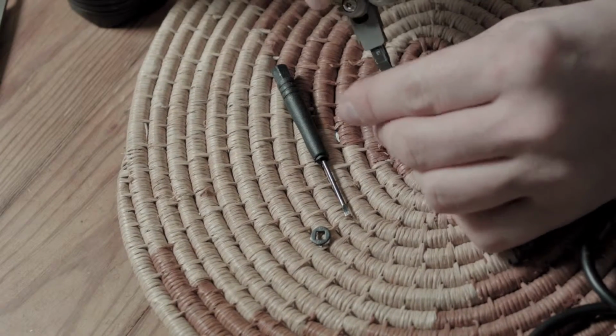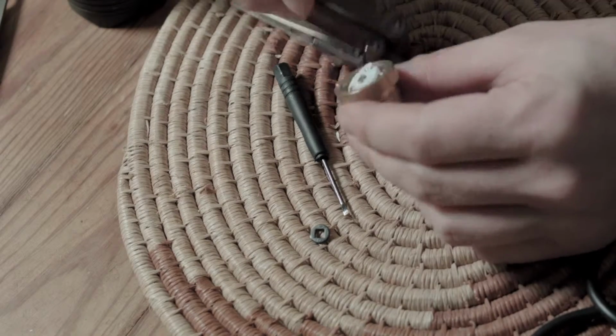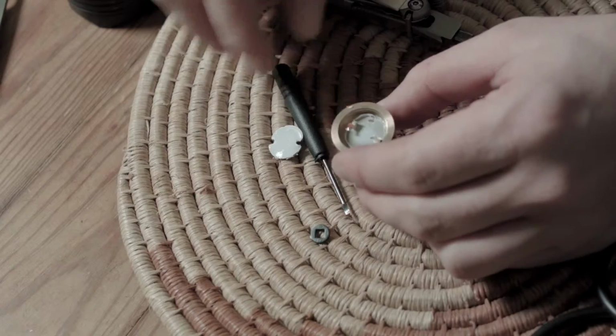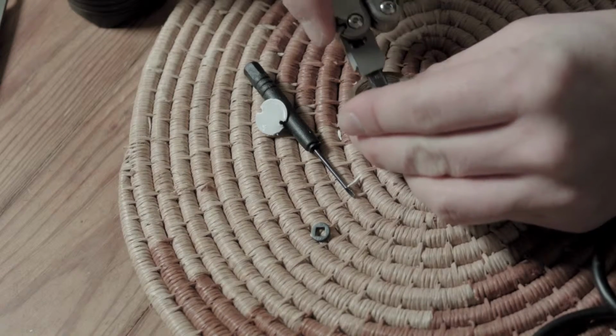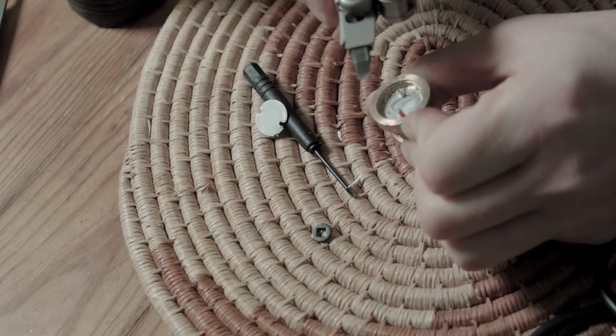Then I take a screwdriver on my Leatherman here and pry up on the MCPCB. This one is glued with some thermal adhesive by evil people, and it makes it harder to take off. A lot of MCPCBs, that's like a mouthful, have just thermal paste or grease underneath, so prying isn't necessary. That is, unless you want to look tough.